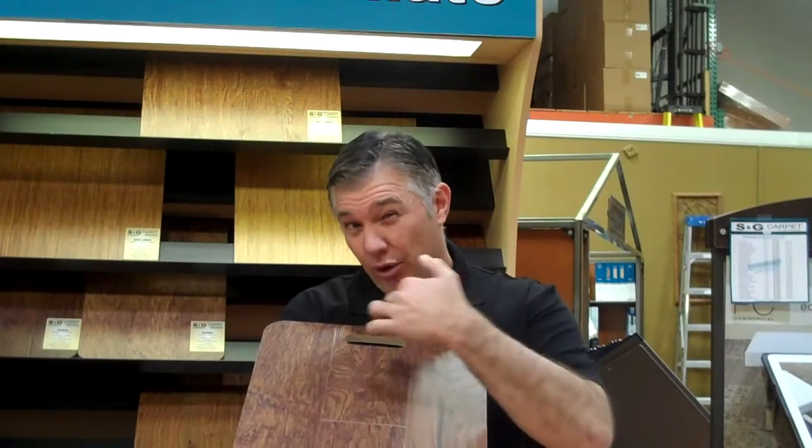With a pressed edge, it makes the product smoother. So if there's moisture, like you're rinsing the floor or mopping the floor, some people prefer a pressed edge because it doesn't have that heavy groove look and it's a little smoother. The other thing the pressed edge can do is when we actually cut laminate, some of you veterans might remember, sometimes you see a little bit of a white line or a white edge. When something's pressed, it helps alleviate some of that because you don't have that real clean cut crisp line like you do on some of the square edge laminates.